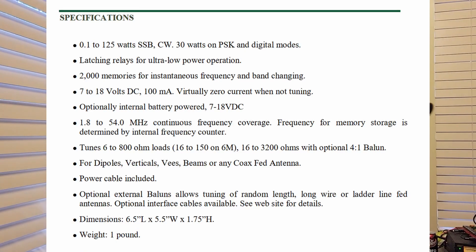Howdy everybody, Steve here, KM9G. That was a quick walk around the dial with the LDG Z100 Plus Auto Tuner. This tuner is good for up to 125 watts on SSB and CW, and 30 watts on PSK and digital modes. It's interesting that CW is rated at 125 watts — I guess it's the quick on and off that it's fine with, but it can't handle the full key-down for 15 seconds like FT8 does. It works out really well and it's fantastic for a portable tuner because it has latching relays and there's room inside for AA batteries. I just wanted to share how well this thing works with the IC-705. I think the Elecraft T1 is probably a better match, but those things are unobtainium. This is a fantastic price and a good package. There are links in the description below, and there's a video right here I think you'll enjoy next. Thanks for being awesome — I'll see you over there.